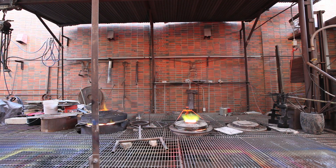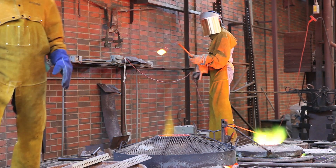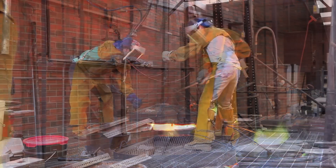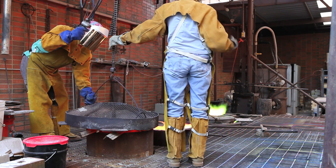Next, it is necessary to steady the molds with their cups facing upwards and heat the bronze to about 2,200 degrees Fahrenheit. It is essential for anyone pouring bronze to wear proper safety gear, including leather jackets, aprons, and safety masks that completely cover the face and neck.